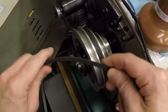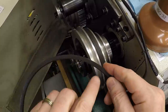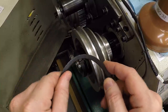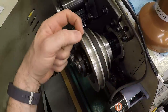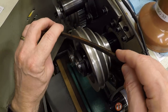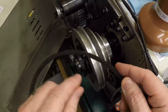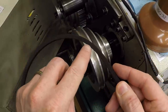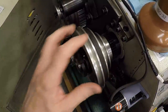But the inside edge, of course, has to get shorter as the belt bends into a tighter and tighter radius, and that compresses the material at the center of the belt and causes it to spread out wider. So the smaller the pulley is, the shallower the V angle has to be to accommodate that. Otherwise, if they were all 40 degrees, which is the standard for this size, type of pulley, then as you got smaller and smaller, the belt would ride only on this inside edge because it was too wide. So you actually have to change the angle depending on the diameter.